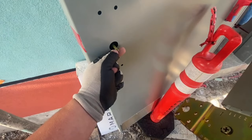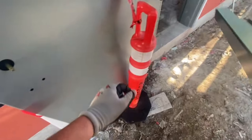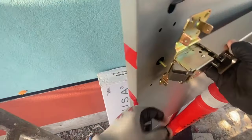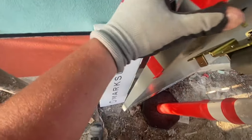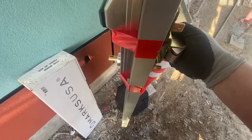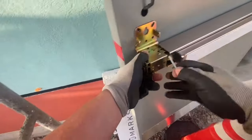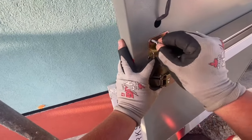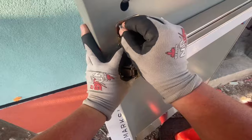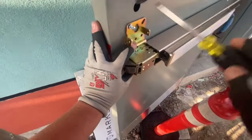First, you got to get that tail piece lined up there into the back side of the Panic bar. That's how it all works. The delineator is kind of getting in the way of my Panic bar. I'm gonna pull that back. Okie dokie. Yes, sir. And slip that in there. There it goes. And then I'm gonna get that first screw started, and sometimes I stick the screw in there and I can't find where it's going, so you gotta bend over and peek in. Once I see where that post is, I can always get that screw going easily.